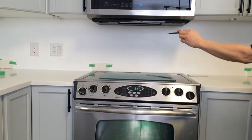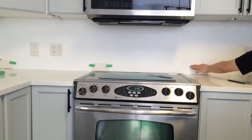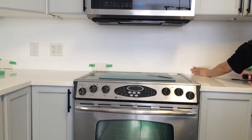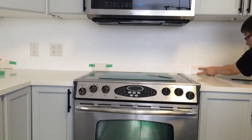First, I place a tile down with a spacer in the bottom, and it should be just on top of that tile, because that tile already has a spacer. Be about there. Something like that. Okay. Try to run a laser again. This takes time, but if you don't do it right and don't think it through, you'll be regretting it. There you go, like that. So the gap in the bottom looks okay to me. This will be my line.